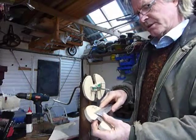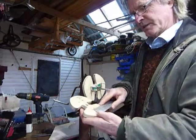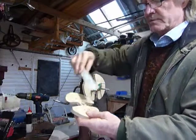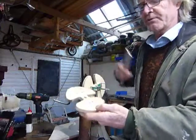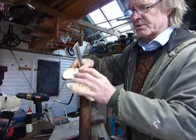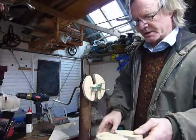I measured the hole layout: 3cm between these holes at the top and one and a half at the bottom. There are 6mm holes and in this case it's 60mm up there to get the shape of the hole in the middle — roughly the same as the magnet but a bit tapered, so as to increase the width of the coil legs so that I can get more copper into this machine.